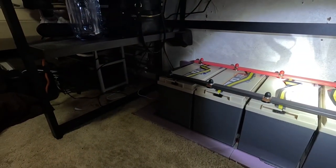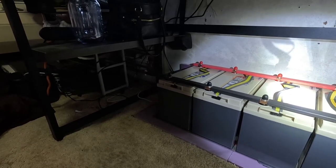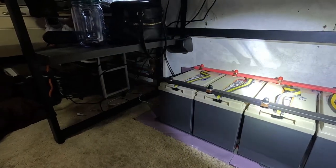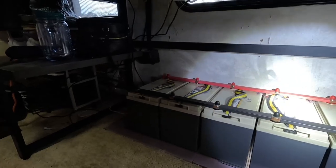Right — when I first hooked up the Multi-Plus and was adjusting the settings, I didn't realize it but it was set at 115 amps. Every time we started the generator it was charging the batteries at 115 amps, which was a little bit too much — it was starting to overheat the Multi-Plus. It's amazing that it'll do that. If you're interested in buying Power Queen batteries, be sure to use the link in the description.